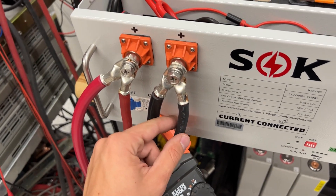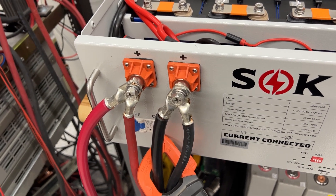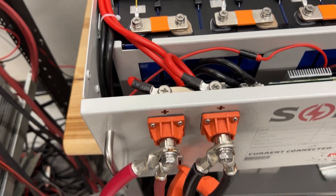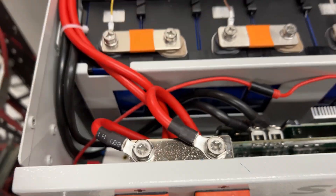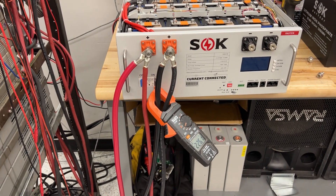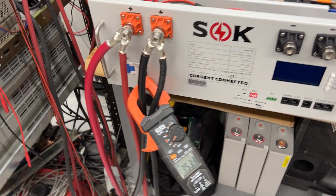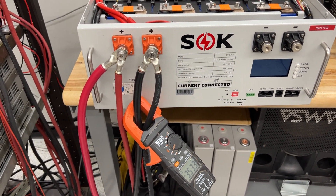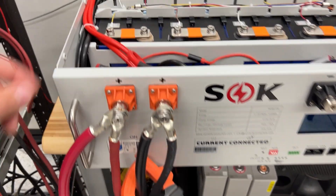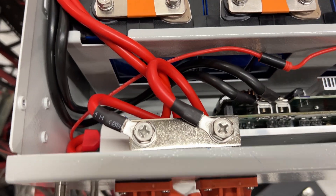I am a little concerned because my bottom power supply only has a 2-gauge wire and we're going to exceed the rating of 2-gauge, but it wouldn't be HitechLab any other way. I'm going to go ahead and get some current turned on. Currently with 225 amps on this, it's not even warm to the touch. So let's push it with a little bit more current. I've been running this for about 10 minutes now at 350 amps, and I'm kind of trying to find the sweet spot for a continuous rating. At 350 amps, it's still not too hot to touch — it's warm, definitely noticeably warm.